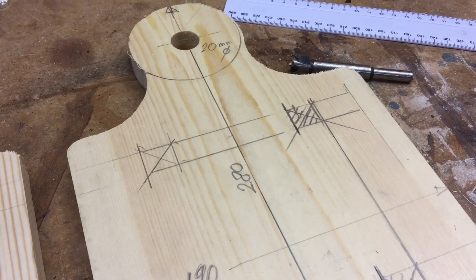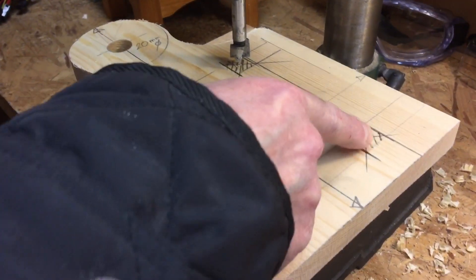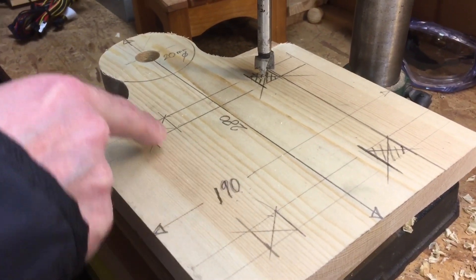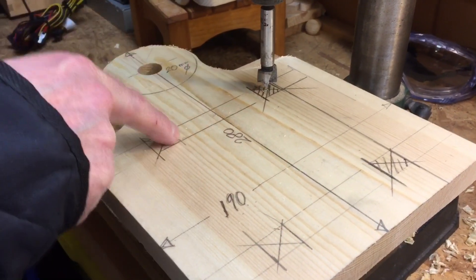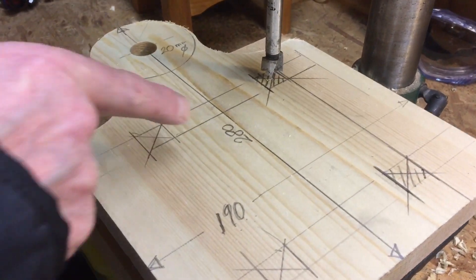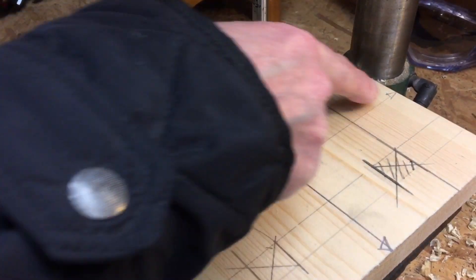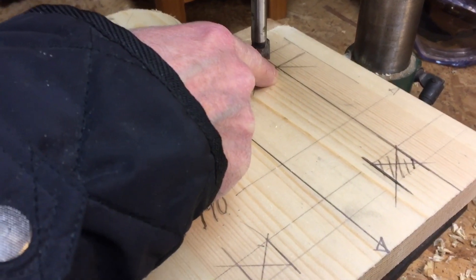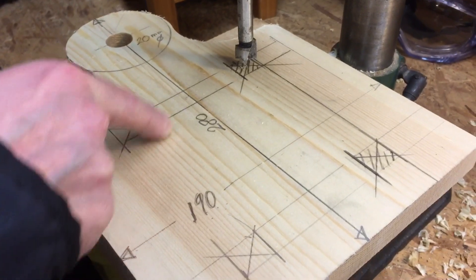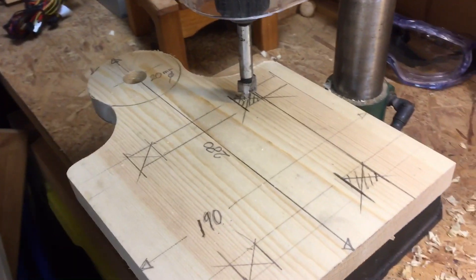On to the pillar drill — we've got them all marked out with the centre line and two diagonal lines, all evenly spaced. It's all carefully marked out: 280mm total height, 190mm total width, marked in from the side about 25mm. We're going to cut it out with a Forstner bit. Goggles on and off we go.